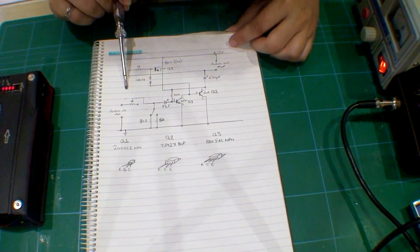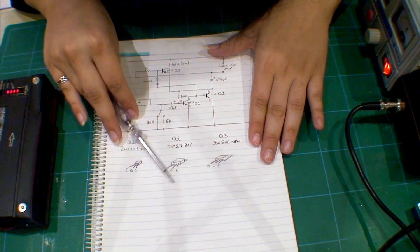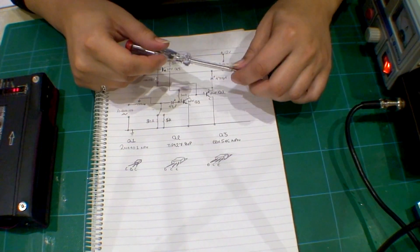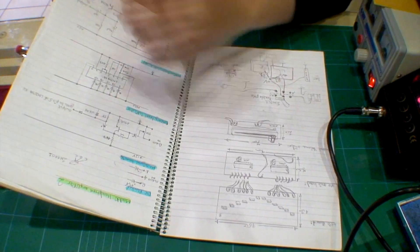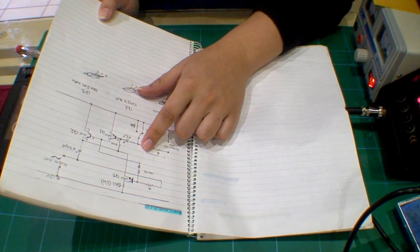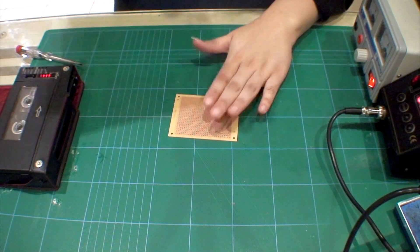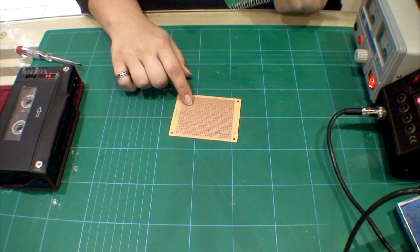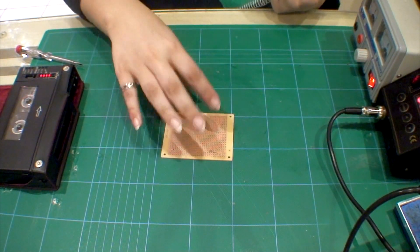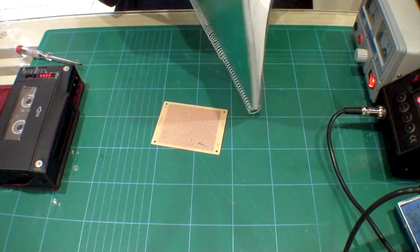The amplifier circuit I've actually modified and improved. For battery power it will be the efficient side of it, but with higher performance it's also going to be powered by an adapter, by choice. I'm going to try to put all the circuits — including the main amplifier — on one board, or as much of it on one board as I can, because the last headphone amplifier I made had boards everywhere with wires in between — more chance of error. I want to make everything nice and clean.